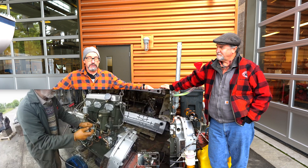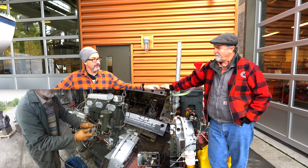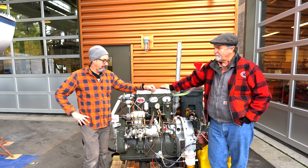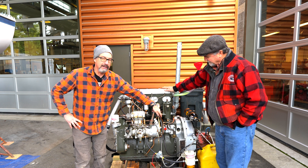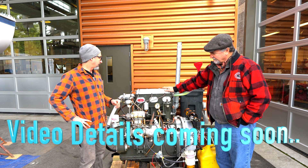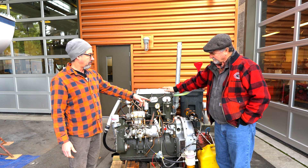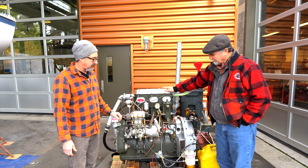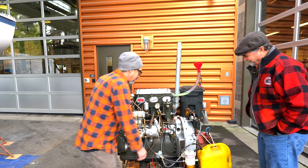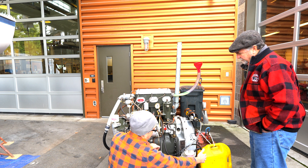The plan is to design the boat around this engine. They found it on the internet through Joe McCool — 99% certain it was running in Ireland about four years ago. Here at Marine Tech they freed up the seized fuel rack, got the governor working, and got fuel to everything. Without a keel cooler they bypassed that circuit, got coolant in it, and fitted a pre-lube pump to squirt fresh oil in before the first start.